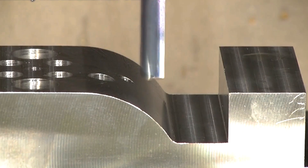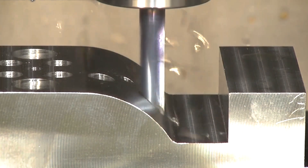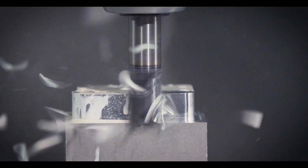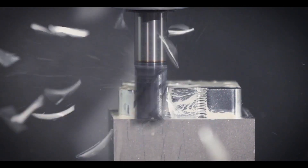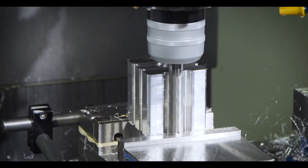The way we get our customers' productivity up is by increasing spindle speed and feed rate. When we put that in and they see how much cycle time savings they can get just from using this drill, they're usually blown away and want more. It's the same with our taps — we gear a lot of them specifically for production-style customers who need low cycle time. We design these tools to run at high spindle speeds, like our EXO DC tap with coolant through, so we can rip through material.